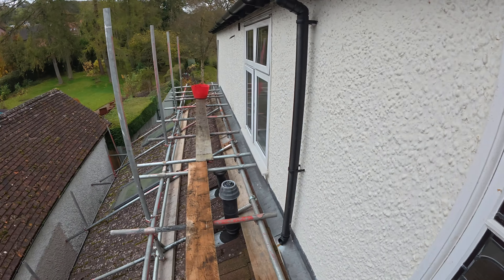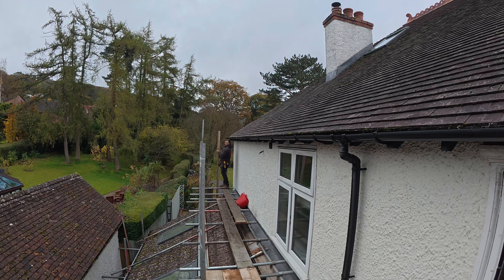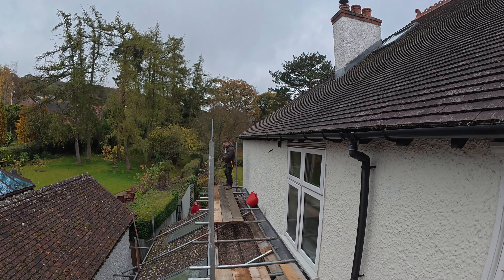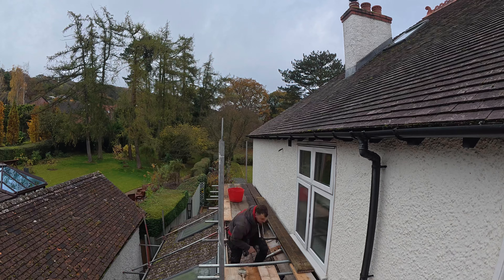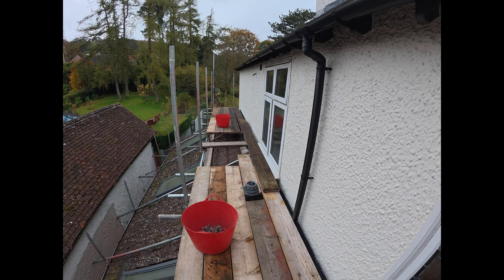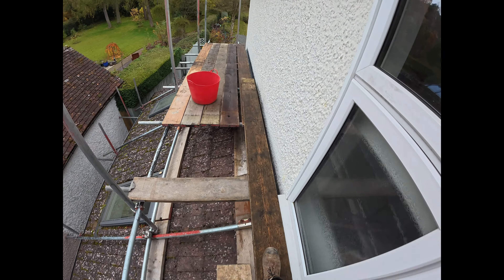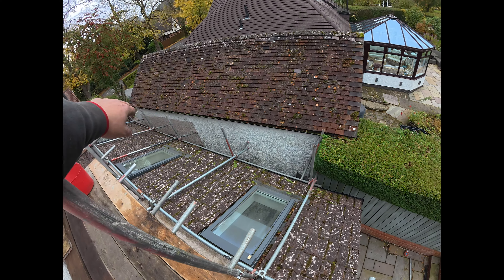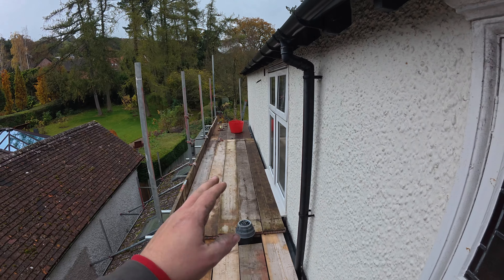So they can get to everything here — all easy for painting. That's going to need some work there, I reckon. That's where we're at. Lap set over here because we haven't got the short boards — I thought we put the right ones on but it's a bit longer than I thought. I hate doing that, but there we go. Ladder will go down here. We've done all our throw-ins off the roof — we've put a tube in there and then raked it back to the wall so it can't move. All we've got left to do now is lap set and handrail toe boards.